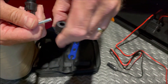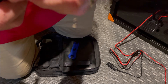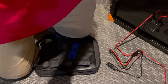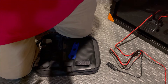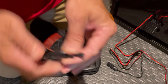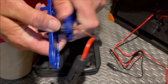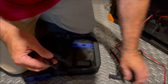Put the cap over top of the pin, then the rubber portion over the pin — remember the rubber portion goes in the connector. Push it down into the connector and listen for the click. Make sure it's in far enough. Put the cap on and tighten it down, grab the wrenches, two clicks, and we're done. We've now converted our 8mm adapter to MC4.